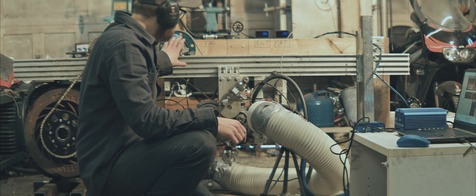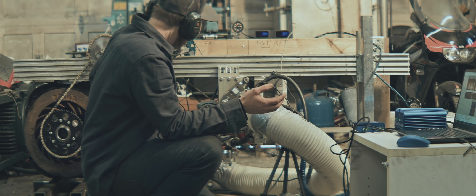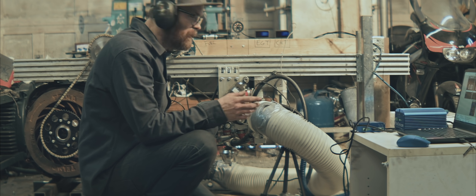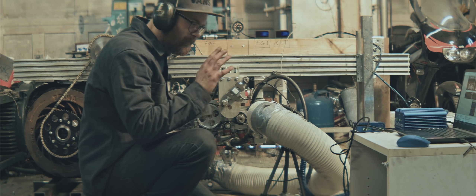With the gear ratio and the clutch, I can't start the run at 5,000 RPM as I tried — nothing is engaged and it just applies full power and nothing happens. I'll try starting the run at 10,000 RPM. I'm also suspecting it's running out of fuel at high RPM, so keep an eye on that.